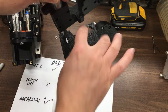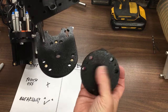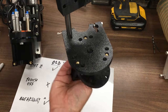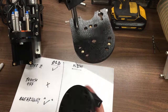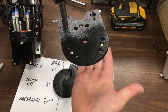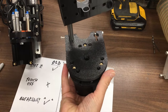These ones will hold M6. No, these will be for the pins, the tapered pins, like we had before, to allow it to self-center onto those. In fact, it will sit onto there, which holds the torch, and the pins will go into the center hole there. So there's three of those, so it kind of sits like that, and it'll always balance back. And then in the outer pair of holes, there'll be 6 M6 bolts with springs on each. So rather than having one spring pulling up only in the middle, I've got 6 around the outside. You've got a much bigger lever moment to try and control the torch. Hopefully the torch will stay in place under all normal conditions, and if you hit something it will move, the sensor will detect that, and then you'll e-stop from there.